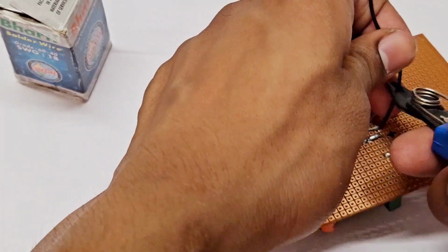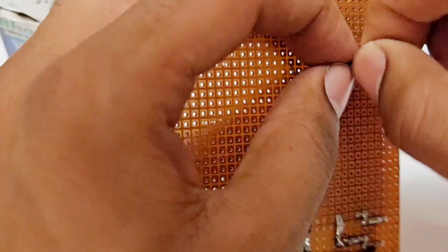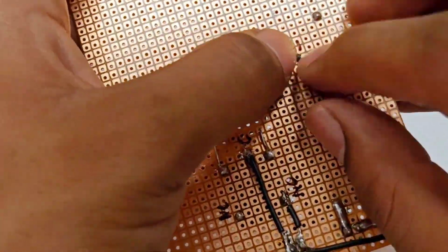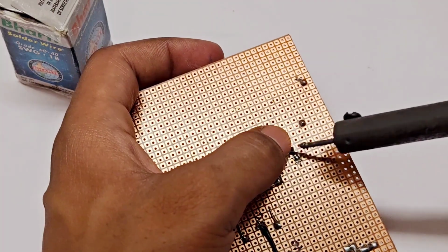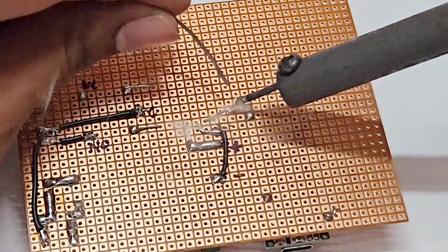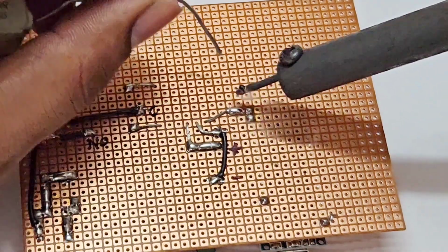This circuit process is very simple. It takes input from the IR remote, received by the IR receiver, and sends that hex code to Arduino. Arduino processes if the hex code received from the remote is the same as what is set to perform any task, so it runs, else not working.